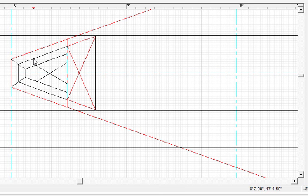This would be 2 layers of 3/4 inch African mahogany, or if I can find 1.5 inch solid material, and this in here would be some type of filler, probably the same Doug fir that I use. Or I'm thinking about switching to Western Red Cedar. It's got a better price point here. So for any of you who are watching, let me know what your thoughts are on Western Red Cedar. It's not as strong as Douglas fir, but it's great for this area, because like I said, this will be left bright, just epoxied very well.